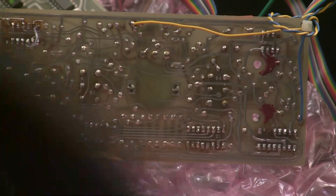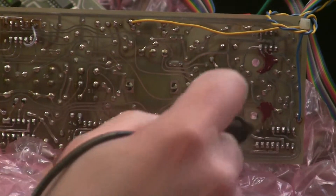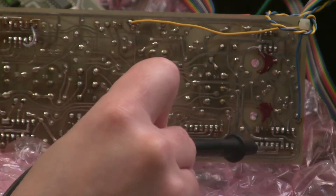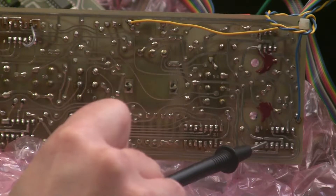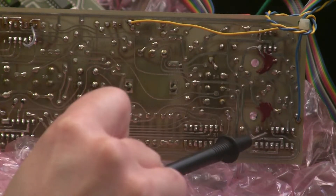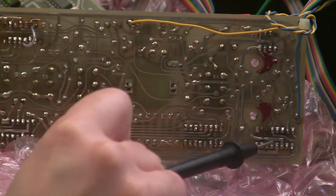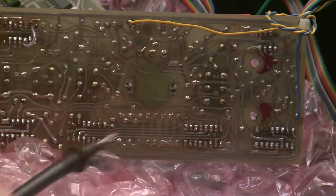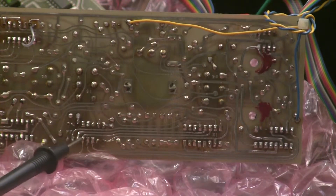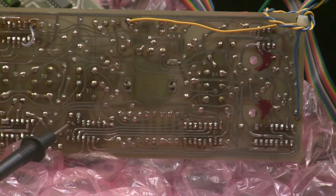I've got board D removed. This is where it comes in from board B. And this is where we replaced a broken trace or cracked solder joint earlier. You can see there are solder pads missing — someone had worked on this board and did a sloppy job. This is what the one I haven't touched yet looks like. You can see pin 9, which is the output of E, is missing a solder pad.